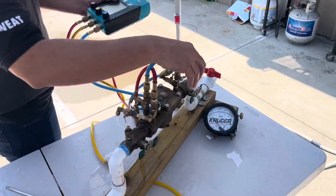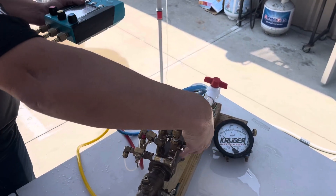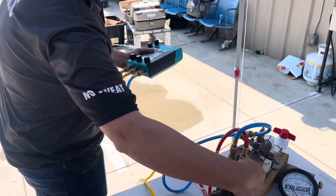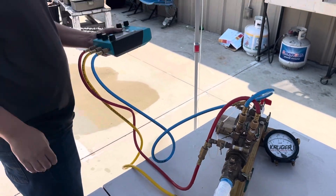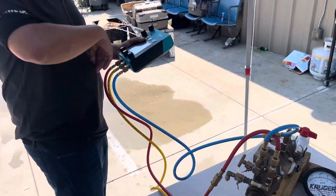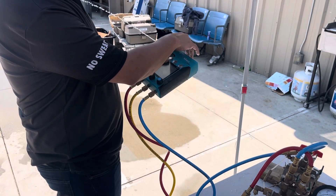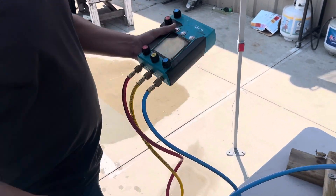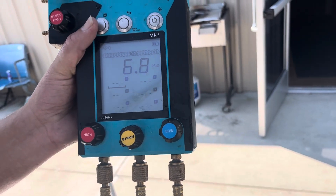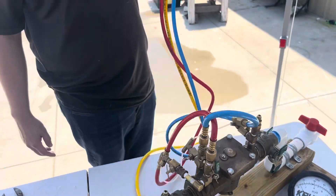We open low and confirm these are closed. Everything's closed. We open low, bleed low. Now we go up: we open high, bleed high. At the top of the hill we close the shutoff. Now we come down, going from the high to the low. We confirm that we have an apparent differential pressure above five and that our relief valve is dry. That lets us know we can proceed with the test.